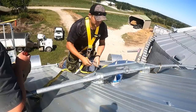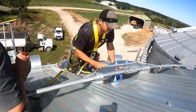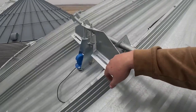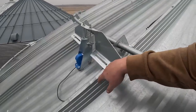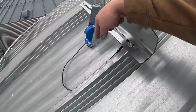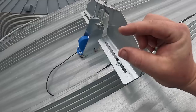We tighten up the bottom bolts and that cable install is done. The sensor cables are actually supported by a bracket installed onto the ribs of the roof. You take a hole saw and cut a hole so the cable can go down through. On the sensor there's a black foam that squashes down with a little silicone and actually seals it up — that's how the sensors are pushed down into the grain bin.